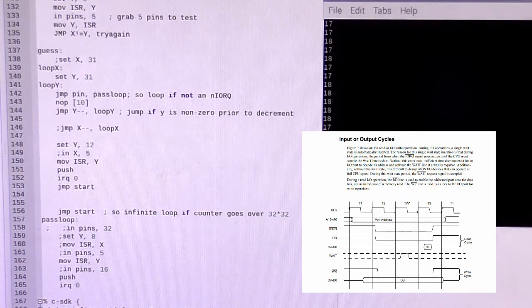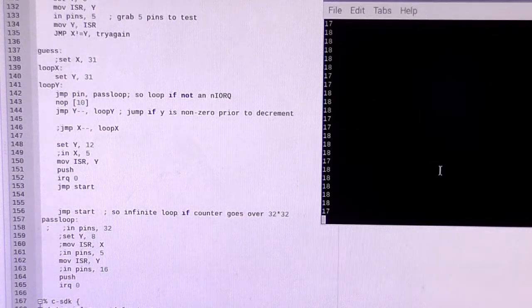But I find this quite promising, and the ZX81 is generating that I/O request, but it must be getting 0 back, I guess, because I've got the I/O port set as input. So the next thing to do, I suppose, is for the duration of this I/O request, to set the pins to output, pin dir, and provide it with some kind of value.